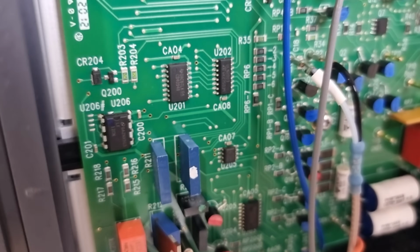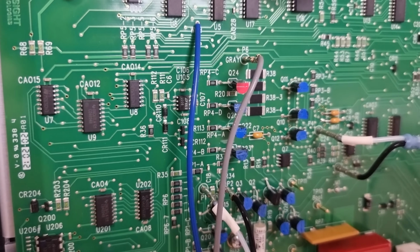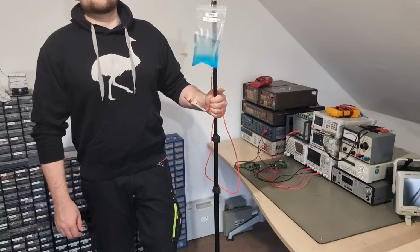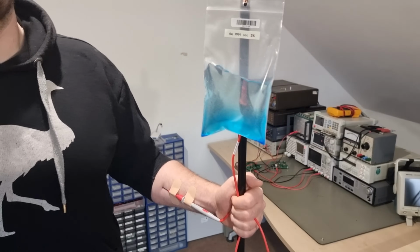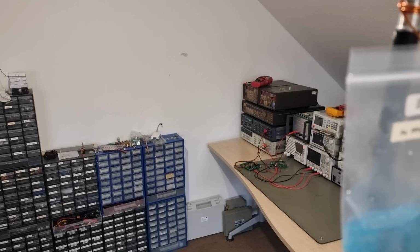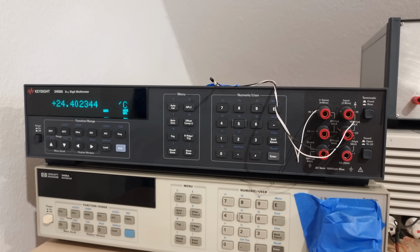As of right now, it's a modernized, deeply backwards compatible design iteration, with lower power and generally higher quality components. The key features, linearity, stability, accuracy or speed, self-calibration and a moderate price, have been preserved. The unit I received has a slightly elevated temperature coefficient in the 10 volt DC range. But that's not a big deal because A, the meter can help itself, and B, I bet there are no serious 3458A users in the world that don't have climate control.